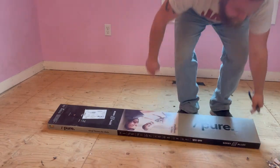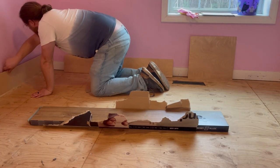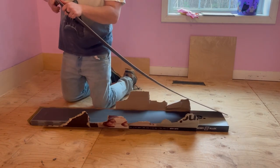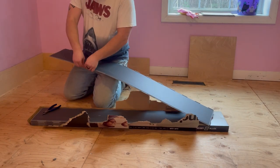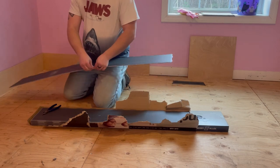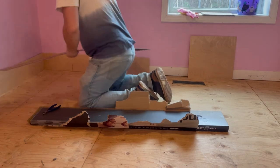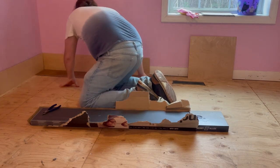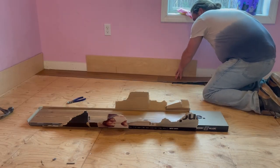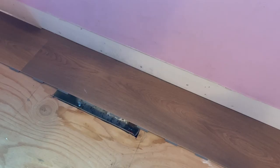Once the room is clean, I can start to lay out my flooring. I'm using vinyl plank flooring that interlocks together and floats on top of a plywood subfloor. The first and one of the most important steps of installing this type of flooring is to leave a quarter-inch gap between the edge of the flooring and the walls around it. I use scrap quarter-inch plywood to create this gap. This brand of flooring uses tabs and grooves to interlock together. I remove the tabs that go against my walls so that they set flush against my plywood spacers, and set my first piece in place.